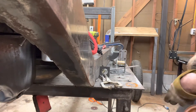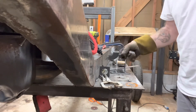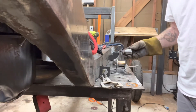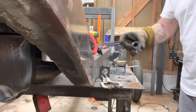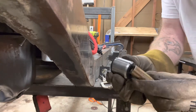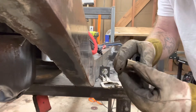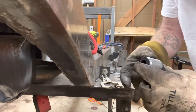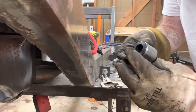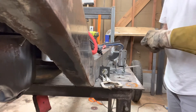Having the bushing in here won't allow the rubber to be crushed. This is all TIG welded up — this plate will mount to the engine. The distance is tightening up as it cools, which is pretty cool. This steel bushing, when you tighten it all up, keeps you from crushing the rubber insert on either side, which is really important. You also need to grease these when you put it all together so everything moves like it should.